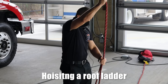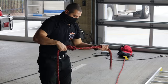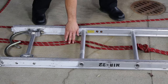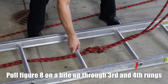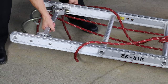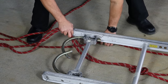When setting a roof ladder up, go ahead and start with a big bight and make a figure eight from that. Make sure it's nice and tight. Now go ahead and go under the ladder and bring it all the way through. Bring the rope underneath, going in between the third and fourth rung — first, second, third, fourth — bring it all the way through. Make sure your bight is large enough to get around the ends, bring that through all the way, pull tight, and now you have the first part done.